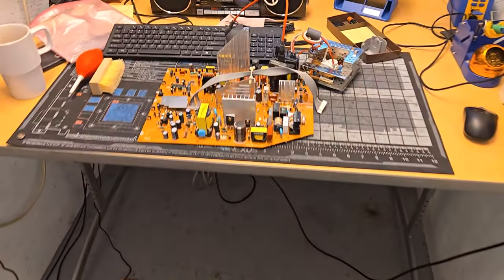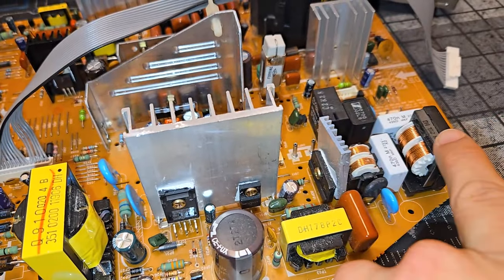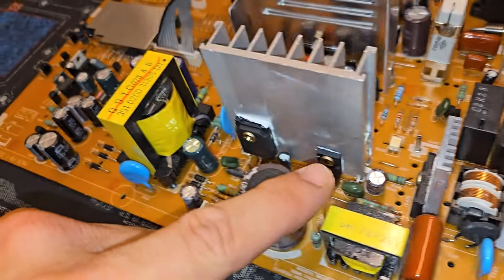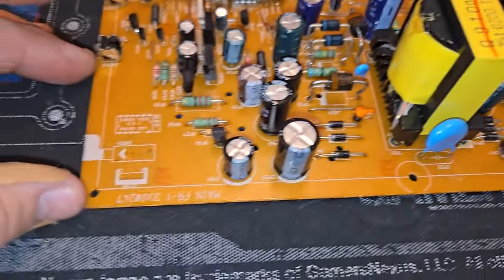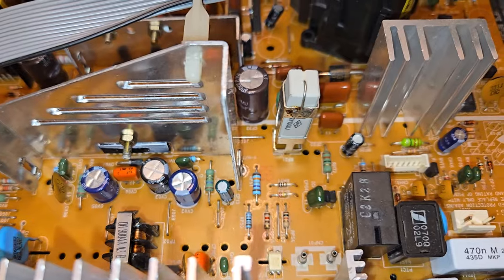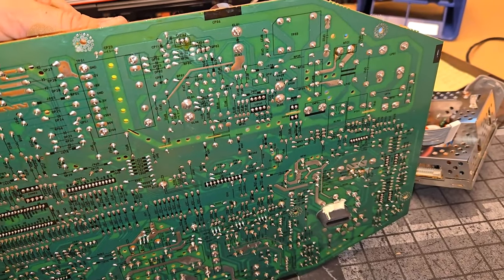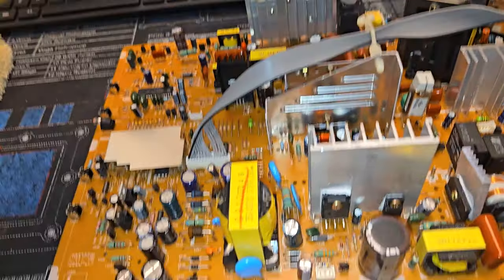And so if we go into the lab over here, we have the board, and this is everything right here. If I look at it, I can tell this is our power section. This is where our main power comes in. Power board area, so we'll replace all this stuff. I'm actually going to probably recap this board 100% because these capacitors, some of them look a bit dodgy just for age purposes. So we'll do all that. The deflection capacitors are going to be over in here near the flyback on that side. So we have to make a custom cap kit for this one, and we'll reflow some solder on these important areas down here, but overall the board looks pretty good.